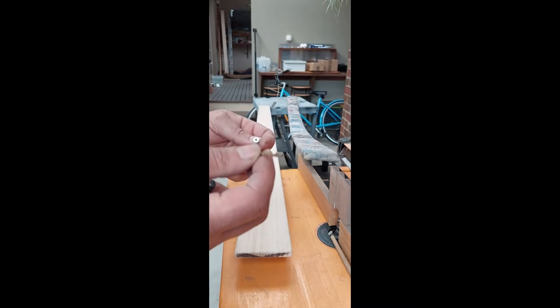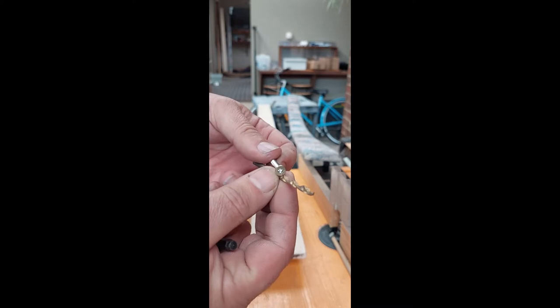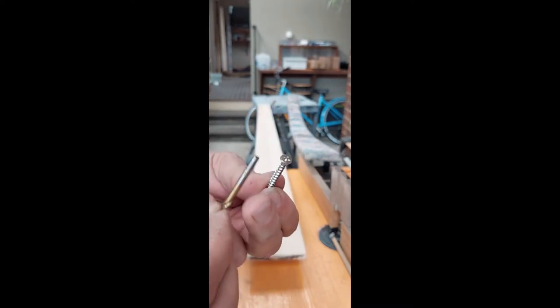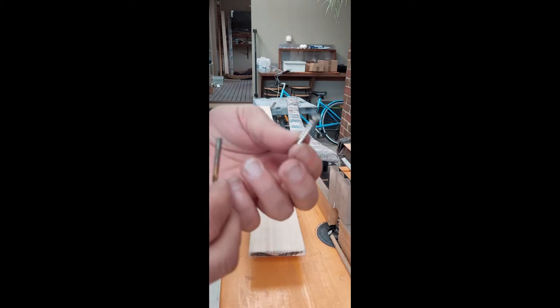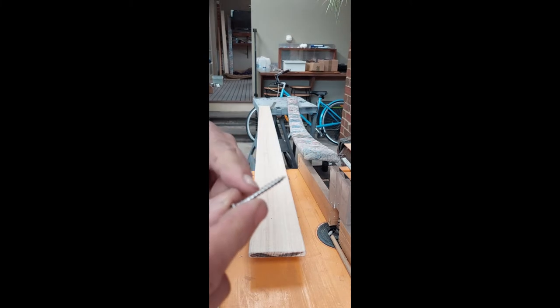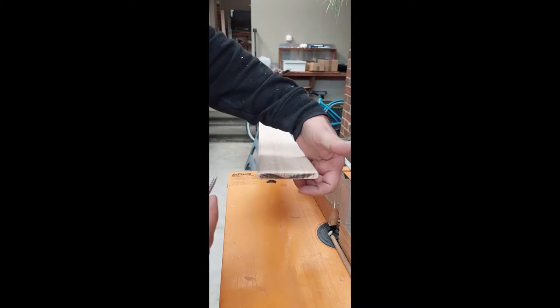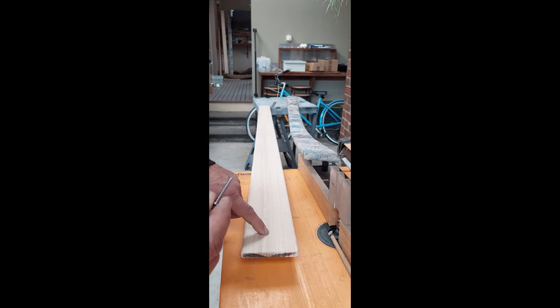So in the wood, I'm going to drill a pilot hole, the same size as the screw. And what that's going to do is it's not going to get any resistance on the sides of the feature timber as we're screwing it in. That means all the force will be going into the timber behind this piece, behind here. And it won't put any resistance here, and that'll stop that splitting, especially on the ends.